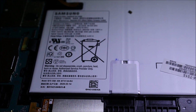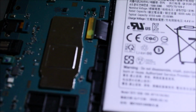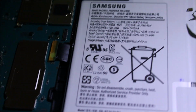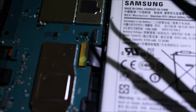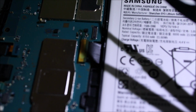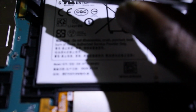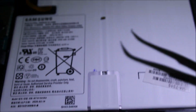and what I noticed is that we have a capacitor that is shorted to ground. So this one is shorted to ground. I removed it, just where the charge is coming here, we have a capacitor right here that is shorted to ground, so I removed it.